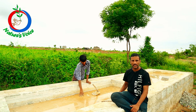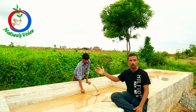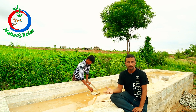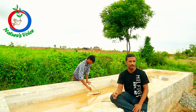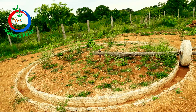Whenever we are ready to plaster or do work with lime mortar, we take a scoop of this and mix it with 3 scoops of sand, along with a few other things like prickly pear cactus, jaggery, and things like that, and grind it in our bull-driven lime mortar production unit.